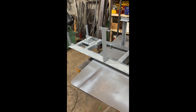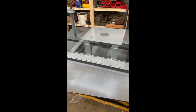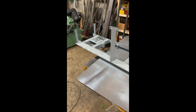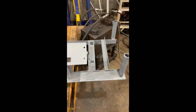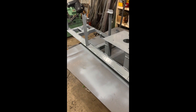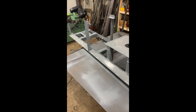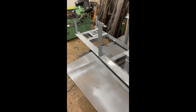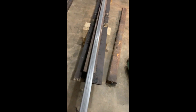Everything else is looking good. I'm going to let this primer dry for a day and try to keep the garage as warm as I can so it cures right. Then I'll hit it with probably two coats of real paint — some brush-on tractor enamel — because this thing's going to take some abuse. Once that paint is good and hard and cured for a couple days, I'll put the motor and everything back on and it will be ready for a test fire.